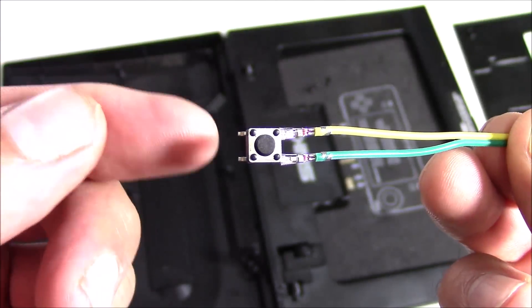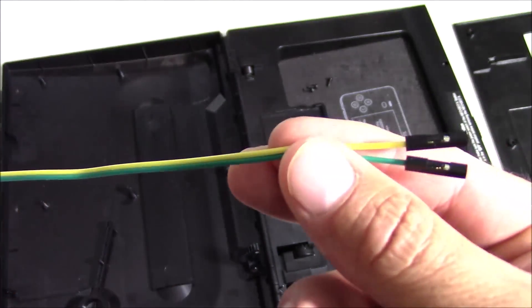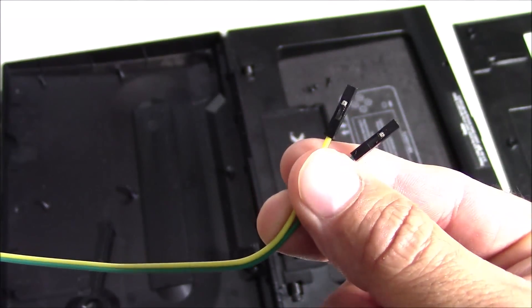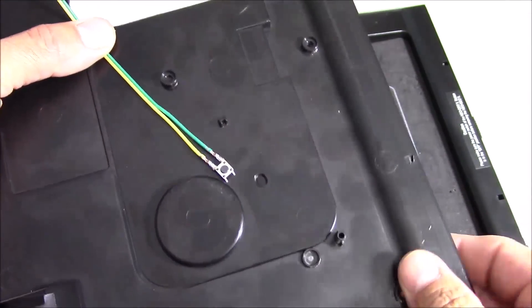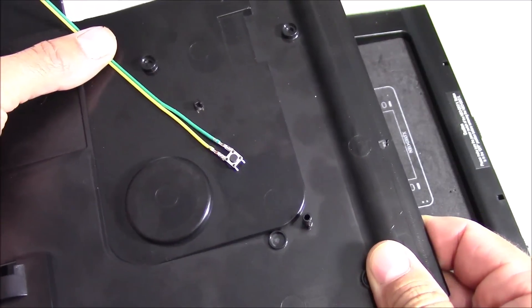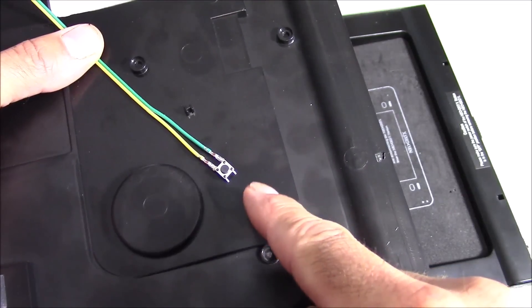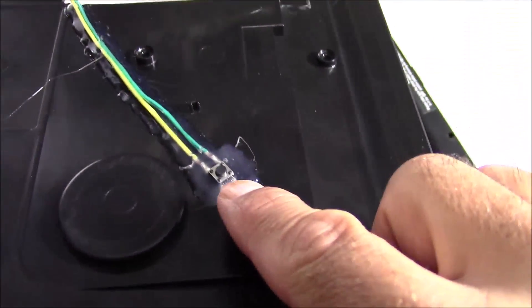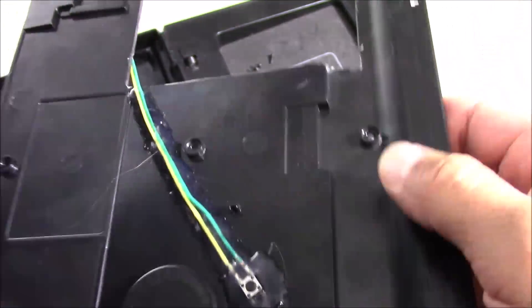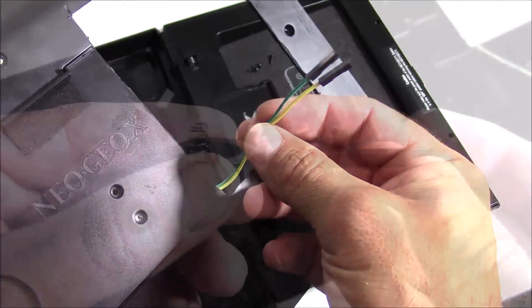For the switch you will have to do a little bit of soldering — two connections. To connect it to the Odroid XU4 board you're going to need two millimeter connections, which are a little bit smaller than Raspberry Pi connections — those are 2.5 millimeter. Once the two wire connections are soldered in place, it's time to glue the momentary switch on top of that hole using a hot glue gun. Make sure the glue does not get too high. I also glued the wires in place, and on the opposite end this will be a disconnect point.